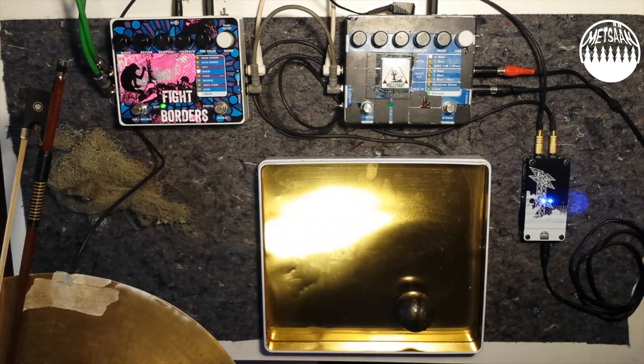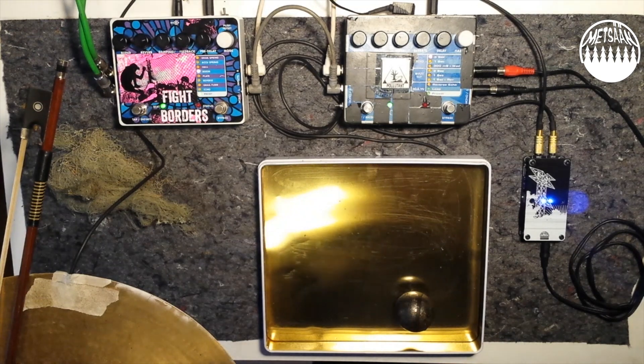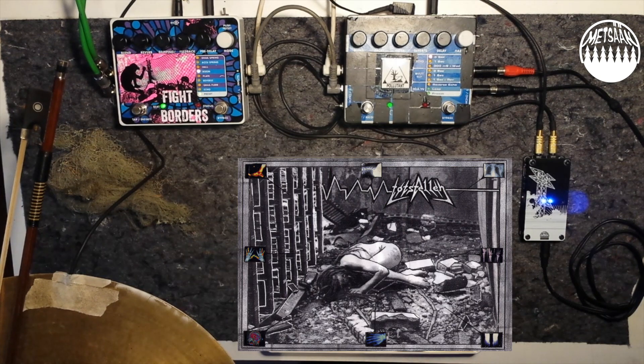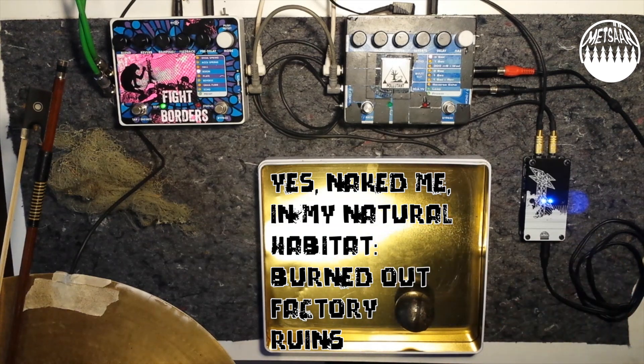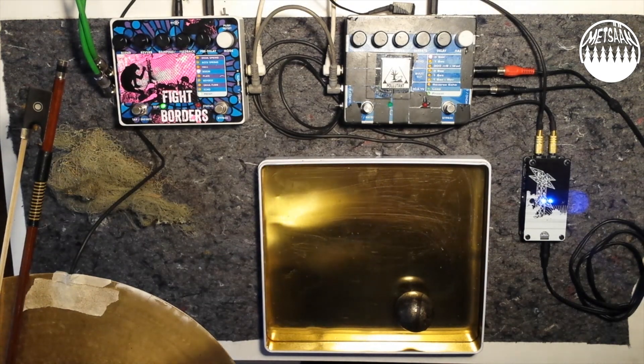The circuit is from industrial applications for ionizing radiation measurement tools and X-ray detectors. It's also used in digital cameras where the sensor chip — each pixel has a certain capacitance — and these also get amplified by the charge amplifier. I have been building a couple of different piezo contact mic preamps before throughout my time of experimenting with sounds, and this has by far been the best to my knowledge, to my ears, and also to the frequency spectrographs I have been checking it with.